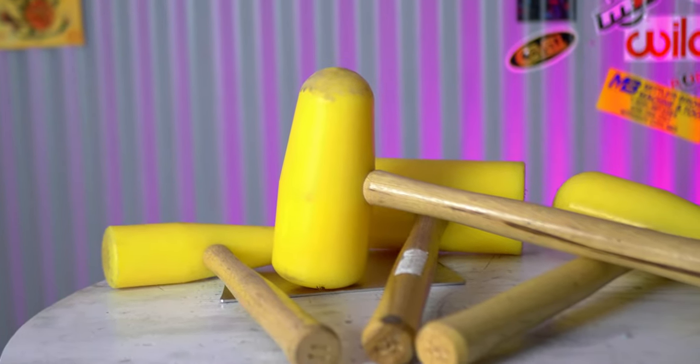Now let's talk about other hammers on the market. Besides plastic ones there are wooden ones and metal ones as well as dead blow hammers. Wooden ones have basically the same benefits as plastic ones: non-marring, reshapable, good heft and weight, and the wood acts as a bit of a shock absorber. They're often even a little heavier than these plastic ones, especially compared to the cheap plastic ones. Personally I don't own any wooden ones — I find they're a little prone to breaking down more over time. The face can mar up a little easier and it might be deeper and harder to redress. You have a chance of chipping or cracking when striking the edge, and you might need to oil the heads to keep them from drying out and cracking. The upside is somebody could more likely make you wooden ones or you can make your own.